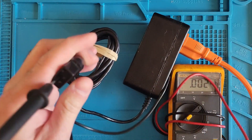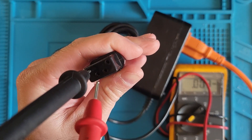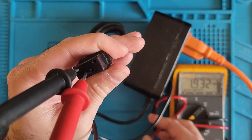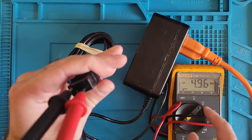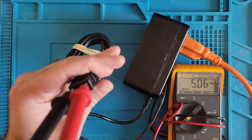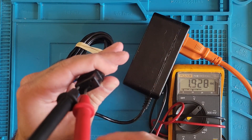Ground — shove that on in. This one should be our 12 volts. We got 1.9. This one should be negative 5 volts — we got negative 4.6, 4.9. And this one should be 5 volts. So we're not getting power out of our 12 volt line here.